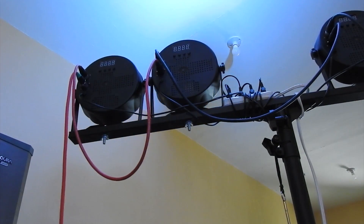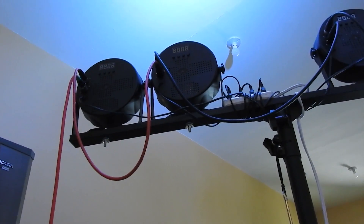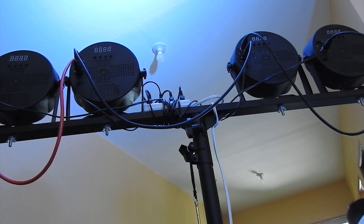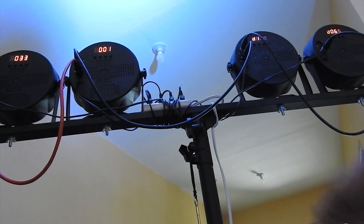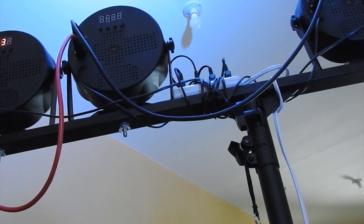To set the address, I'm going to connect the power — let me power it on. So our lights are now powered. I'm connecting it to a power strip and a power socket. You can hear the fans moving. As you can see, I've already set some addresses, but we're going to set the address according to our controller. The first address we should set is DC01. For this tutorial, I'm just going to be using one channel for all the lights — that's the most effective way. Let me zoom in the camera so you can see how it's done and how to save it.